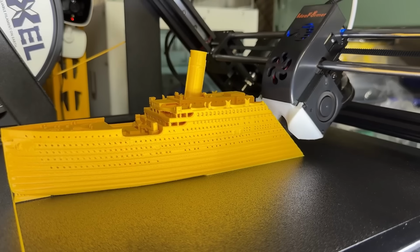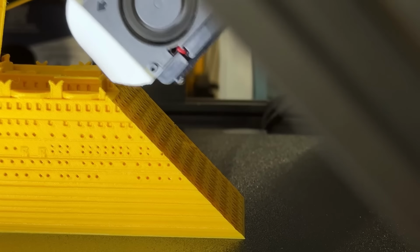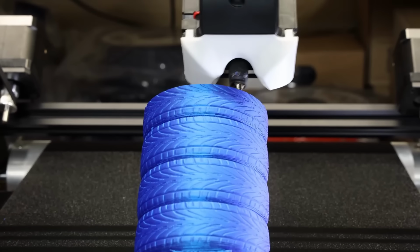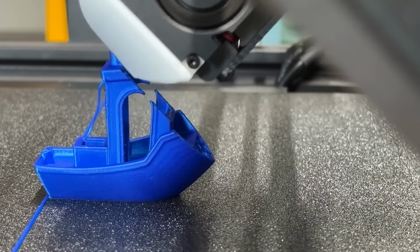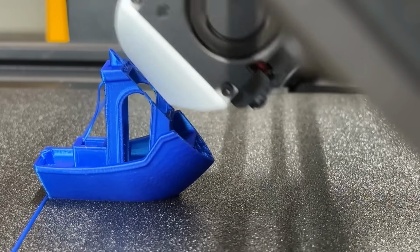2. The print speed is fast. It's 2-3 times faster than other Marlin-based belt printers, and it's the first one in the market. 3. The cooling is also strong. At first, I wasn't sure that these two 4010 blowers would be good enough when printing at high speeds, but it turns out they are turbo blowers. The airflow is much stronger than regular blowers at the same size.